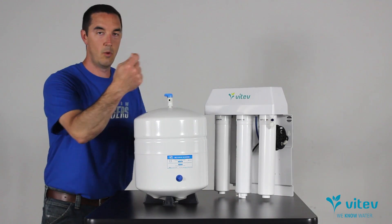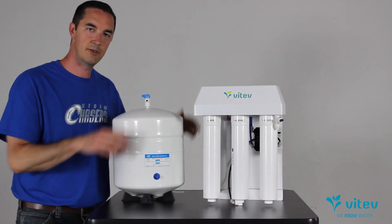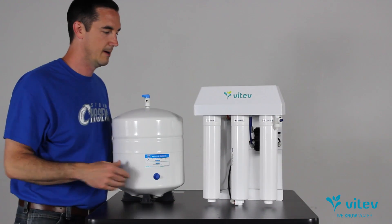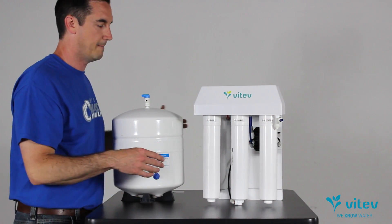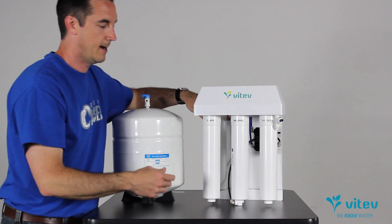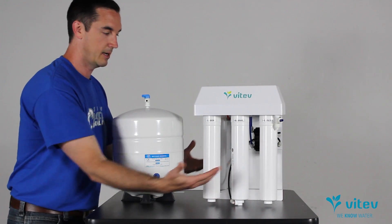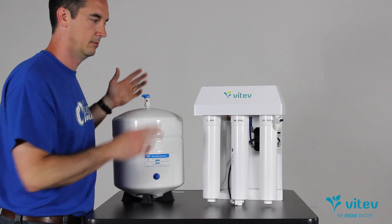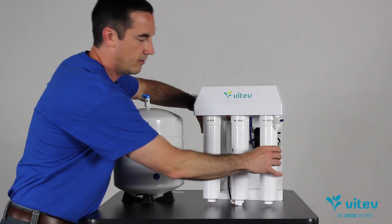If the tank isn't the issue — if you removed the tube and no water came out — then something else is going on, so let's talk about the filters. The same principle of starting further downstream and working your way back to the source applies to diagnosing filter cartridges as well. At this point the tank should be disconnected. Leave the supply on, keep the RO system working, get a catch basin, some containers and towels, because once you find the clog you're going to get a pretty good squirt of water. So how are you going to know where the clog is? You're going to start removing one cartridge at a time.